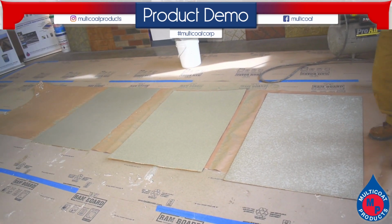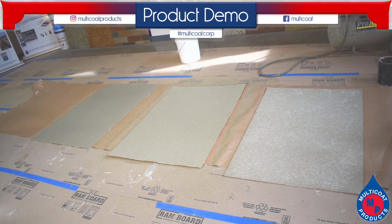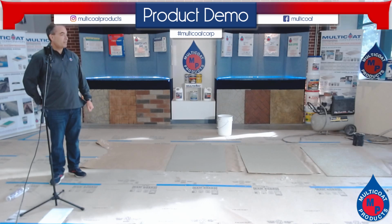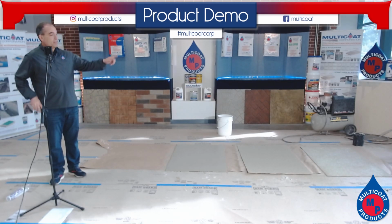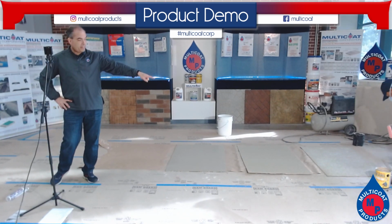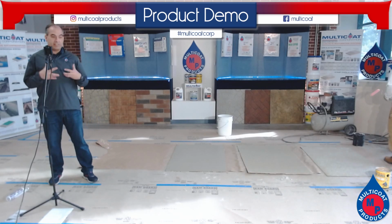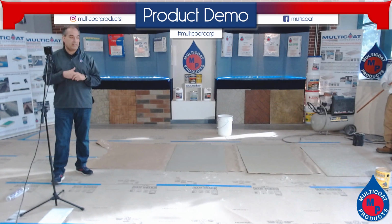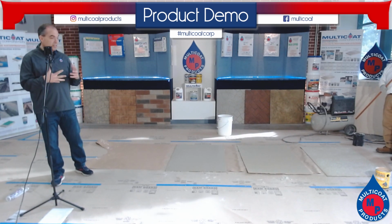So he's got to, after you shoot it with the hopper, let it sit up a little bit like Alfonso said, and then he comes back with a hopper and knocks it down. While he's letting it set up a little bit, he's going to apply our color seal to the third board over here. Our color seal is a unique paint because it has a paint and it also has a sealer inside. And we recommend 2 coats of it.